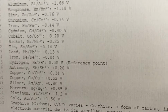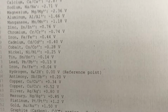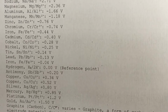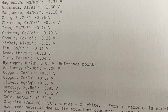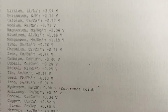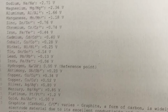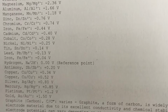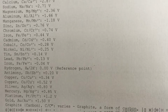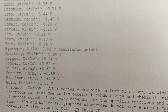So it becomes a challenge of finding the right combination that has the most difference that wouldn't corrode. So basically we use the electrolyte, that's our ion bridge. It doesn't have to be electrically conductive, but you also need another system for the electrical electron conductivity. Typically the fluid, the water, is what facilitates in this sense. So the Zamboni pile and various dry cells that use a thin paper and the moisture in the air, this is the part that would facilitate, as bad as it is, the electron flow.